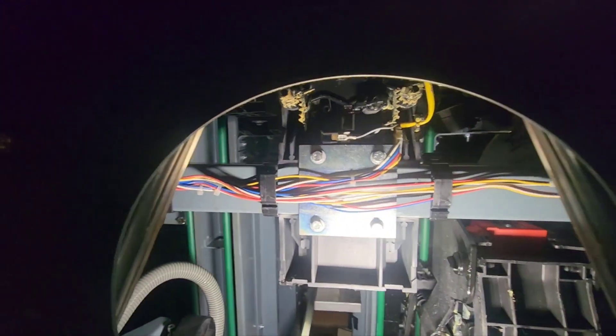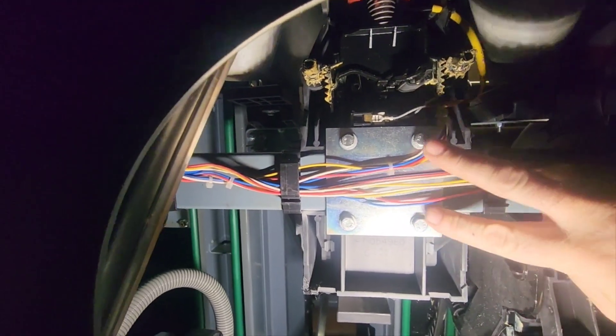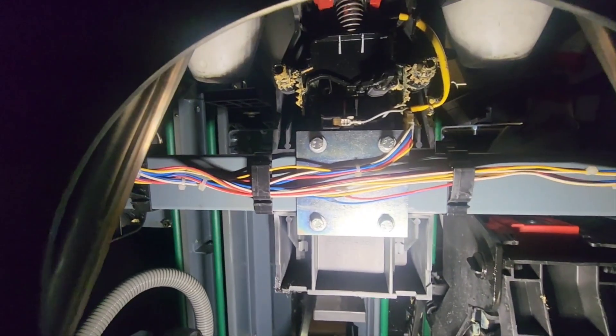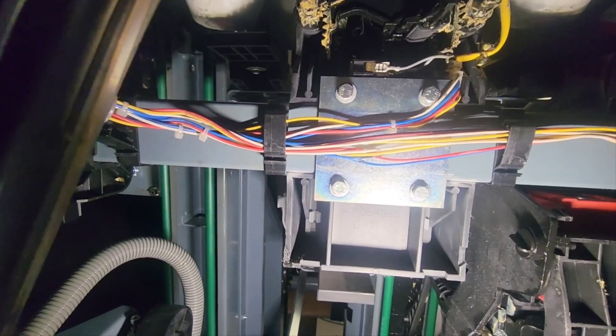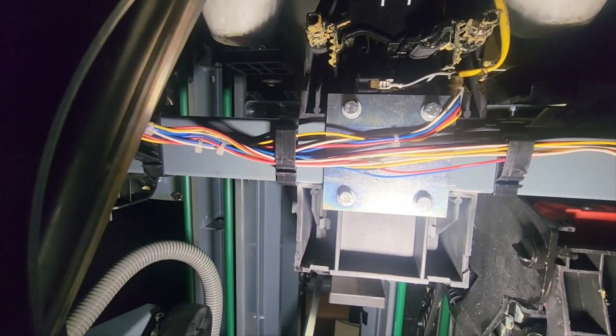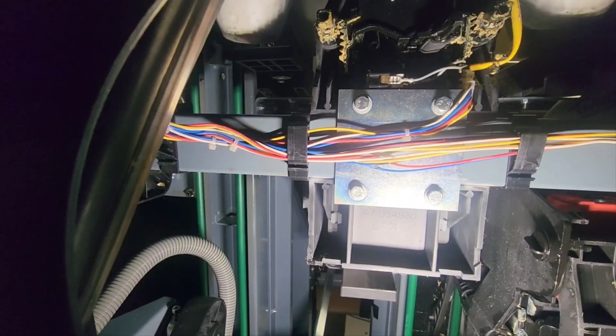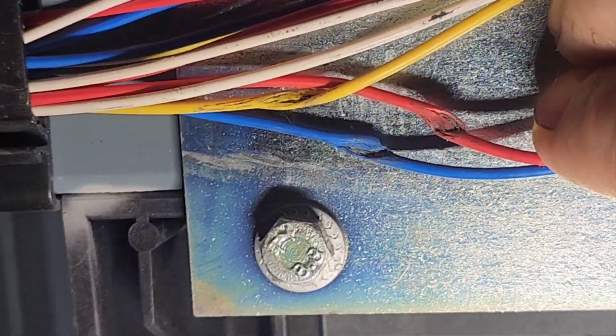I found it — it didn't take long. We pulled all the pin detecting plates off of the seven-ten row and four-five-six row, then pulled the wire cover off the back. I do this with the table up, laying on my back on the pin deck — for me it's easier than hunching over because I have back pain issues. Let's zoom in here.